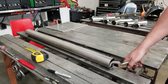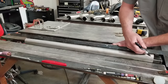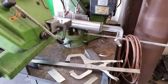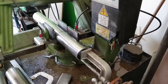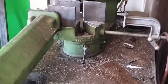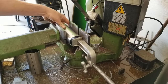We need a reference. Utilizing the same trick from Pie Cuts Part 2, I'm going to measure out half the diameter of the tube, mark it in a few places, then take a straight edge and draw a line to connect them so we have a 50% reference mark on our tube. I'll make the same mark on the saw so we have it clocked in every direction and they're all pretty much identical. The most common merge angle in splayed transitions is 45 degrees between two pieces. So to get the correct cut angles, take the total angle between them, divide by two, and that gives the amount cut off each leg. In this case, I set the saw to 22.5 degrees to get a 45-degree transition.